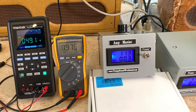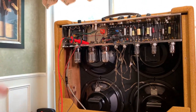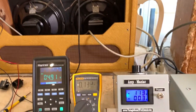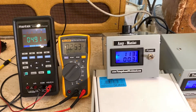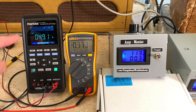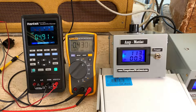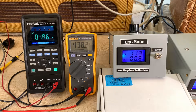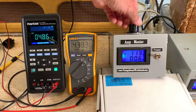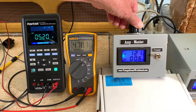I also checked the heater wires on the rectifier — it's supposed to run at 5 volts, which is why you see a 5AR4 (the 5 stands for 5 volts). At the same 113 volts I'm getting almost 5 volts on the rectifier: 4.91. Taking it off standby, I raise it back to line voltage to check what the rectifier heater runs at — the plate is at 470 volts and the rectifier heater is at 5.2.